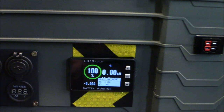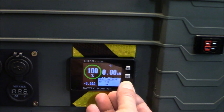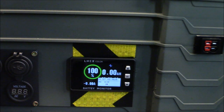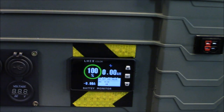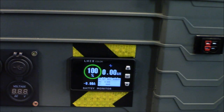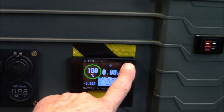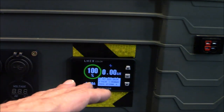This is your color value — your LED value for brightness. You can make it dimmer or brighter; I have it at about a four. This does not time out, so you'll have to keep an eye on it if your battery is very low. Moving to menu item five, this will set the rest for the battery screen and your STI values for one to five amps. You can do this in black and white or in color — I'm keeping it in color, as black and white was a little harder to see outside.